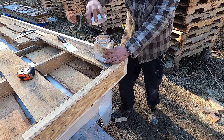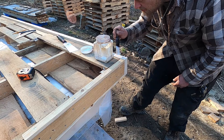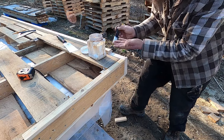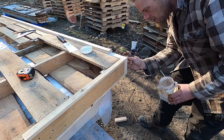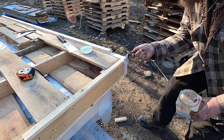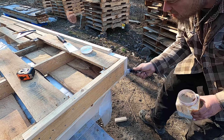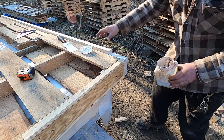This is a little bit of watered-down exterior waterproof wood glue, and I'm just going to put a little bit on where we cut. It helps protect it from cracking — since it's waterproof it'll also stop it from absorbing water. With it watered down, it takes five seconds, lasts forever, and it really is a lot of protection especially with so many fasteners right here towards the end. I've been doing this with all of the oak pallets because they crack like crazy. A little bit of glue and this wall is ready to be stood up and assembled.